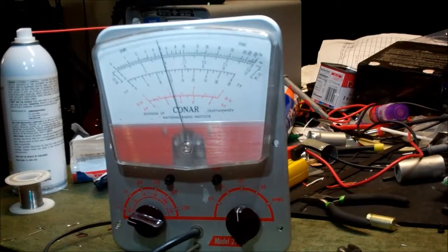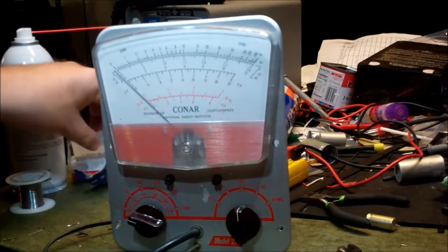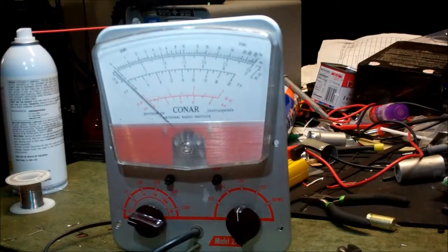Now that might be, you know, under a load. This might be, it's a pukey battery. I have a newer battery here. Let's see what it does with my newer battery. And again, this isn't a reference checked load, so I can't be a cajillion percent sure. We got it set to negative volts, so I got to put the battery on backwards. And again, 1 volt. That's not correct. This should be 1.5 volts.